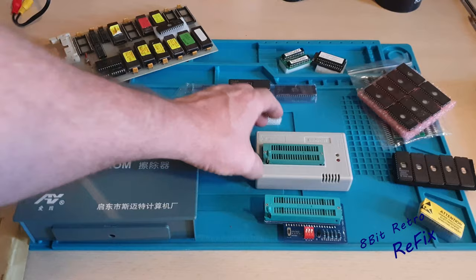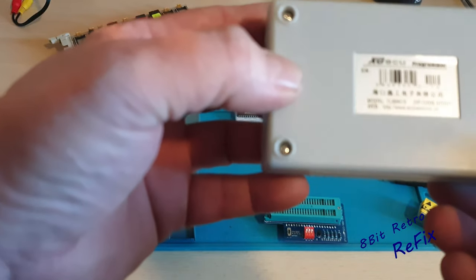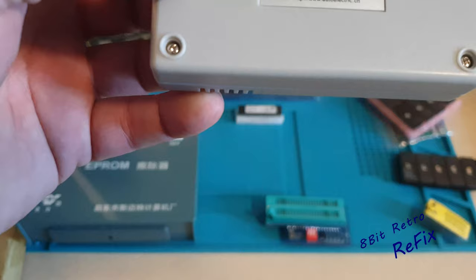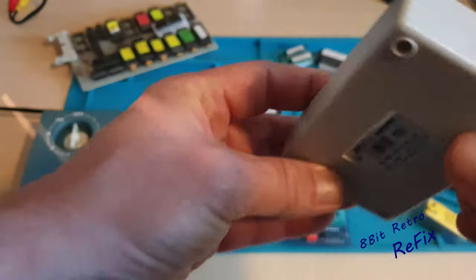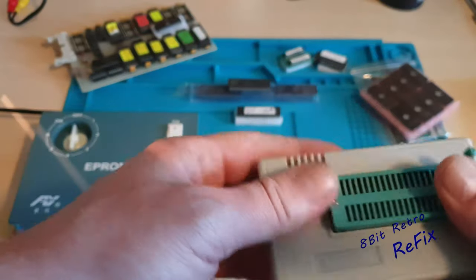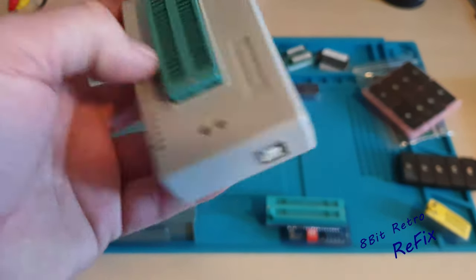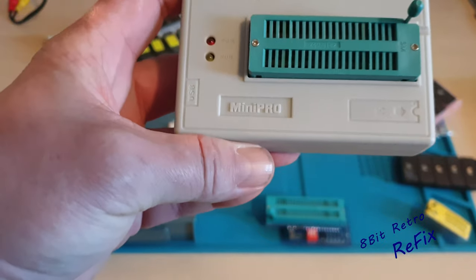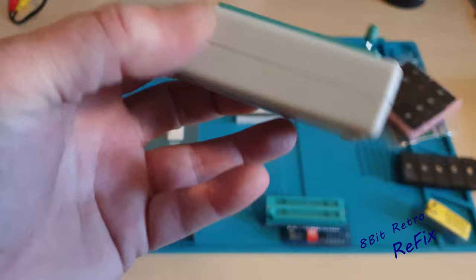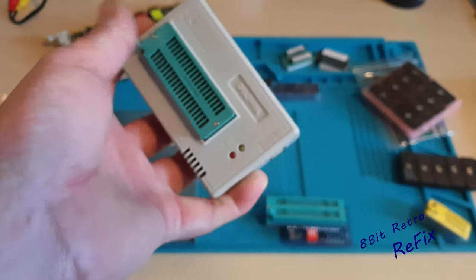So I bought those chips and I went and bought a programmer. It is a TL866CS - this one doesn't have the little suffix on the end. You've got to be careful when you go out and buy these things - if they're genuine, absolutely fantastic. If they're not, do not update them with the software. If you update them with the software and it is not genuine, you'll end up with a brick. My suggestion is make sure they are genuine, or if you have got one that's working for you, just don't update it. There's no need to - if it's working, why update it? It's just a gamble.